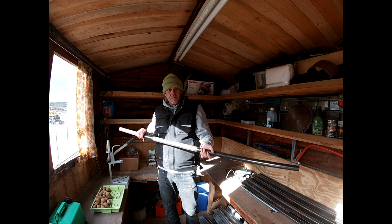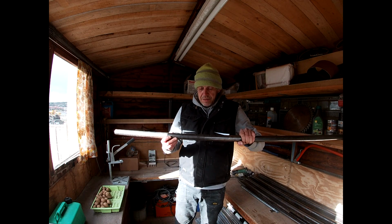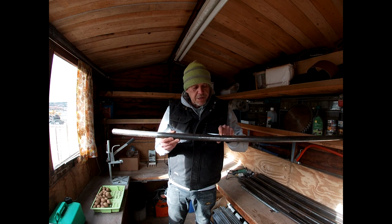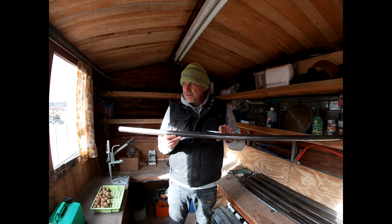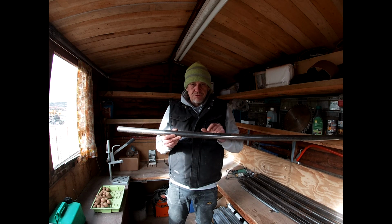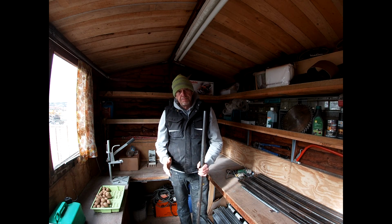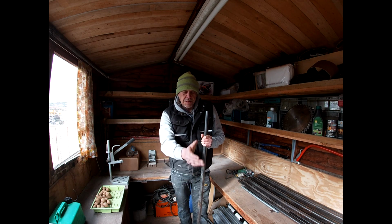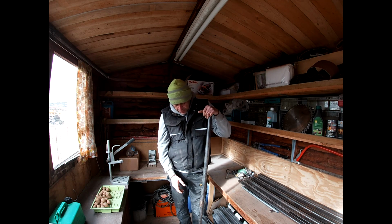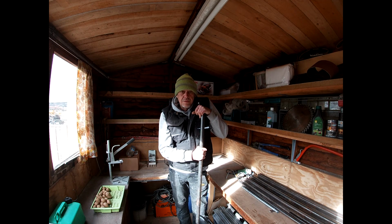and then I'm going to put a wooden base rail around. So if you can see this black mark here, that's where the wooden base rail will start, that's where it would finish. So it's a 6 by 1.5 inch base rail, and then here and here I will drill some holes for 8mm bolts and bolt the wooden base rail to these tubes. So that's the plan. And the first thing I've got to do is get all these tubes marked up and then try and drill the holes through them. So let's see how we get on.